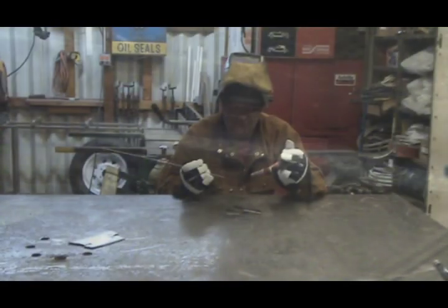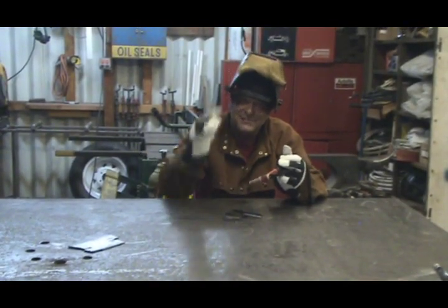If you look at the weld here, you can see the little stack of dimes that they always talk about as being a good weld — a good cosmetic, good-looking weld. This is where I was just kind of dabbing the rod in as I needed it, and this is where I was just letting the arc pull the rod off as it wanted because I was working my way along. That's how I do it. Hope that helps. See you next time.